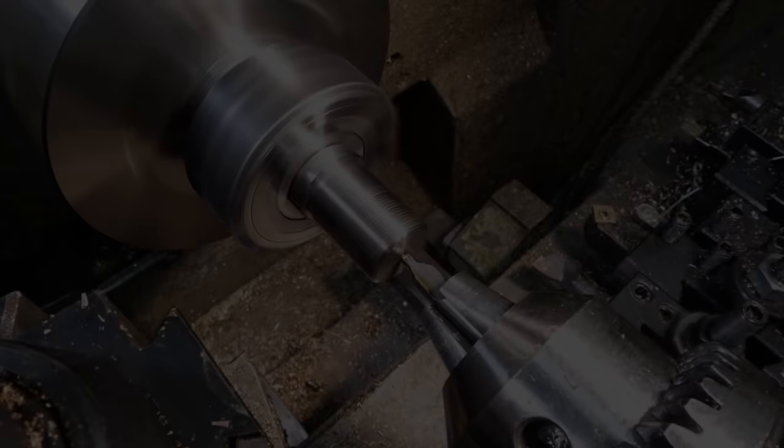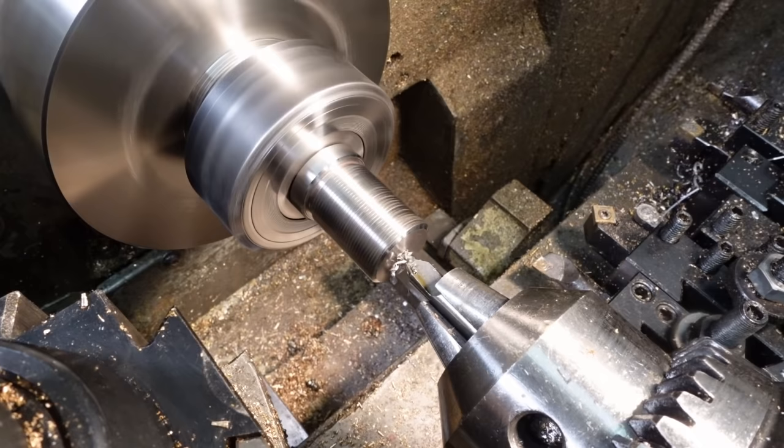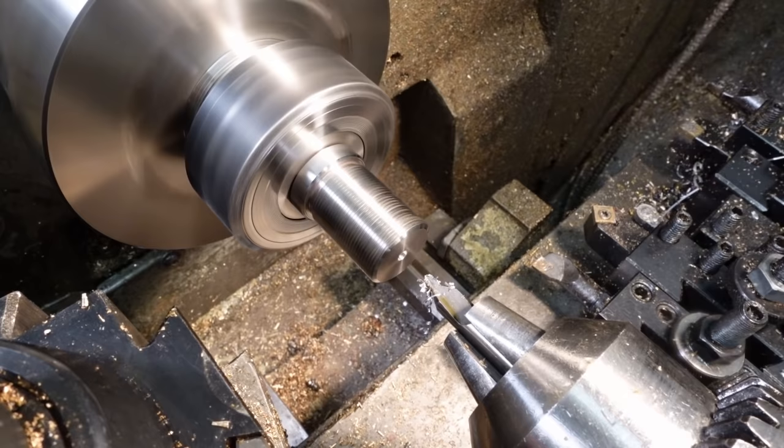The screwdriver bit's socket's 11mm diameter and the hex shaft's 6.35AF, so I'll drill a 7.2mm hole to accommodate that, and drill and ream the hole 11mm for the first 40mm or so. Look, the exact number was on the print, and I use it to write a shopping list, okay? I'm sure these things happen even in proper shops.